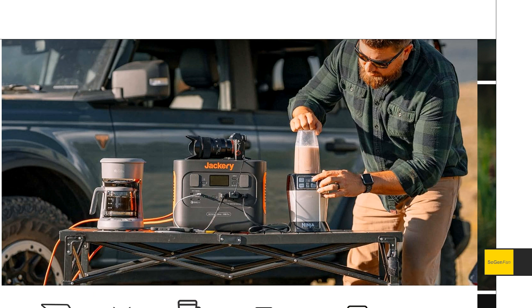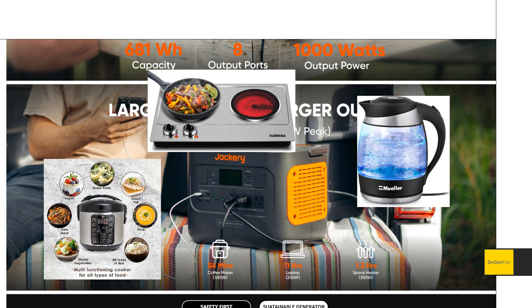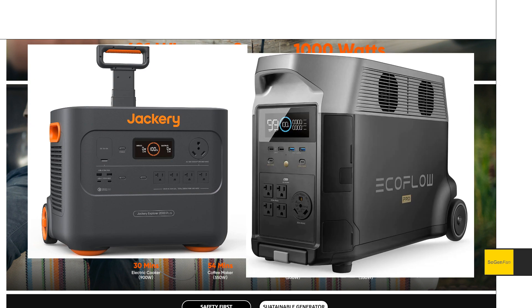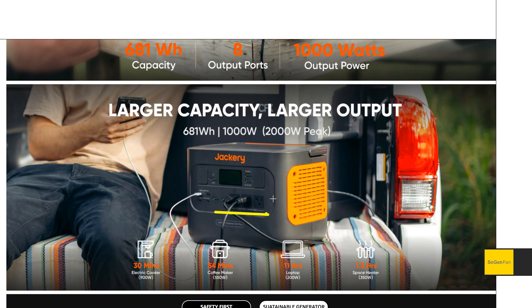You can still do a lot with this inverter if you get the right size appliance. They show an electric cooker at 900 watts — you'll want to look for things around 900 watts if you want to heat water, use a coffee maker, or a hot plate. The advantage of a smaller inverter is that with the right appliances you still get the capability, but you'll use a lot less power. A lot of people want a 3000 or 4000 watt inverter, but that might draw something like 50 watts just having the inverter on, not even powering anything.